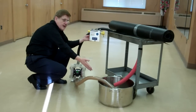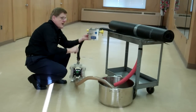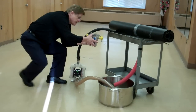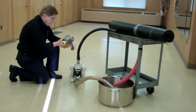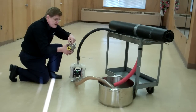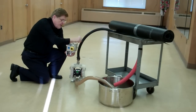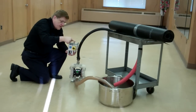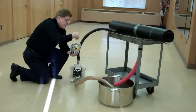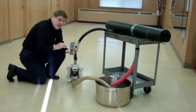At the end of the run when the ink is being taken out, you have to flush this with solvent — you can't leave it sitting with ink from the former run as it'll dry up inside and cause a malfunction, as with any in-line viscometer. Another option is to put this in a bypass line: the ink comes up from the pump, splits — some goes through the viscometer back to the tank, some onto the fountain. When changing jobs, a valve can switch to flush solvent through the viscometer back to the tank, leaving it clean. This part stays on the machine frame at all times, with hosing connections appropriate for your installation.